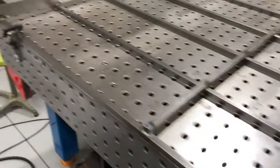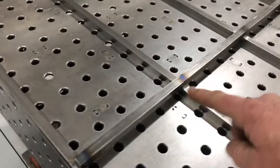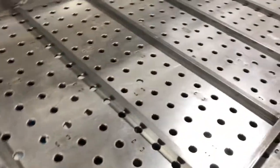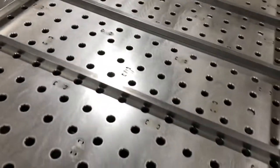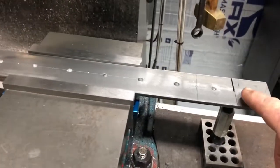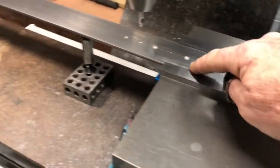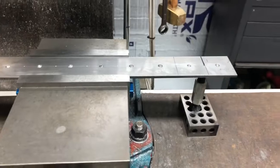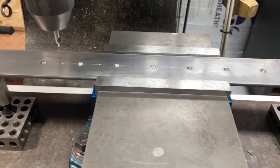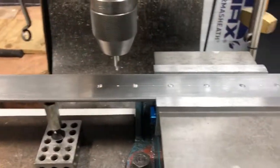So here's the back side, all welded up. Got the spreader in the middle — that's how people can't spread the bars apart and do damage. This is 5/8 solid square stock, TIG welded — you'll never get this apart. All right, so here I'm making the mounting tabs. I'm just using the DRO to help me with spacing. It's all got to be the same, might as well make it exactly the same while you're at it. There are eight mounting tabs on each set of bars.